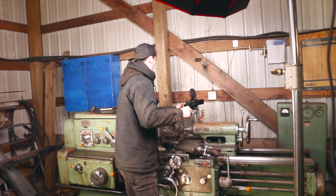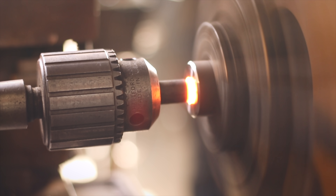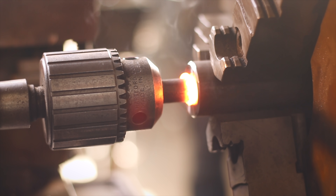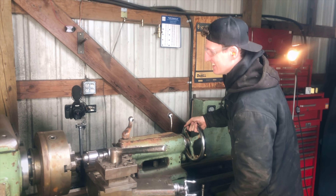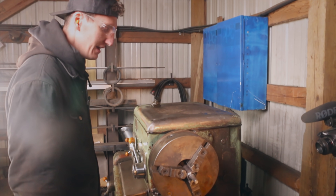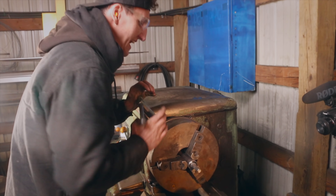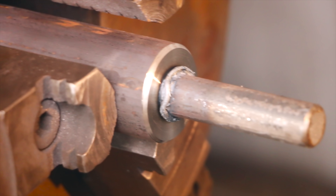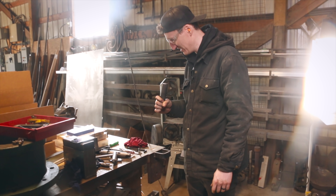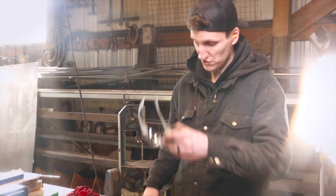I'll just get these machined up and we'll do it. To me it felt like the inch-and-a-half round bar wasn't hot enough — it was just the five-eighths that heated up. So either I needed to spend a little more time there, or I should preheat the inch-and-a-half round. Let's take it out and see what happens. It did have some fusion but not much. I'm pretty sure I can get that, but I'm gonna keep going because it's not actually what I'm after today.